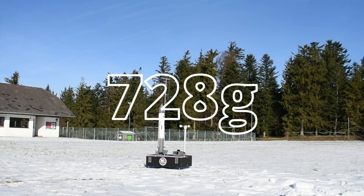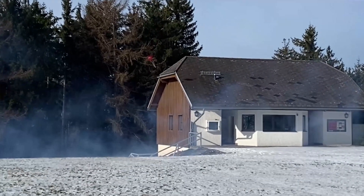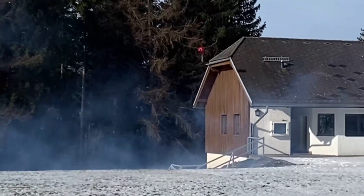Nine, eight, seven, six, five, four, three, two, one, ignition, liftoff! This was the cleanest rocket ascent I've ever achieved. The rocket didn't use any ascent fins, so no passive stabilization was active. There was quite a high roll rate and yet the rocket remained perfectly stable all the way up till about engine burnout. Then the rocket deployed all the mechanisms at the exact time and in the exact manner as expected. The descent rate of both the descent and ascent stage was quite high. Still, you have to keep in mind that the parachute of the descent stage only acts as a backup — in normal operation the rocket would attempt a propulsive landing.